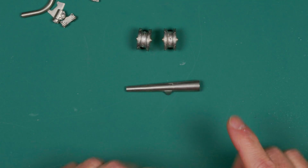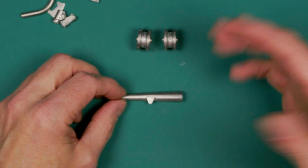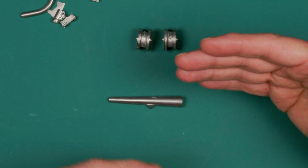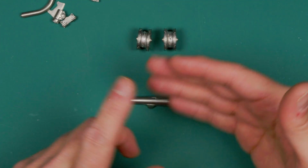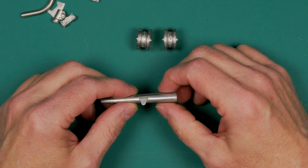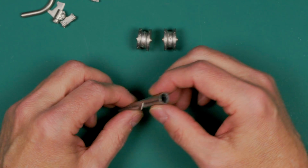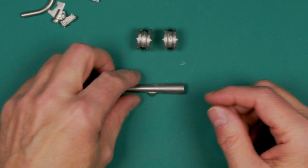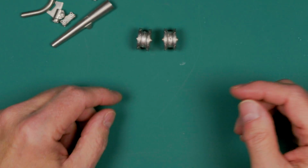So do what you need to do to get the part fitting well and to get the part immobile, so it's temporarily fixed where it's supposed to be. Don't glue it. You don't want to contaminate that joint. Tape works well. If you can tape the part but still access the joint, that's fine. The tape won't burn or anything like that, so there's no risk there. So that sets us all up for actually doing the solder joints.